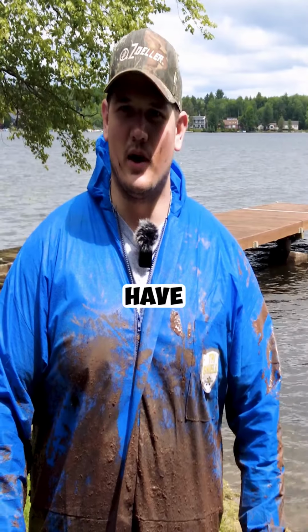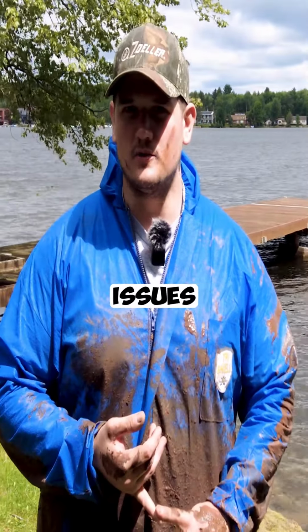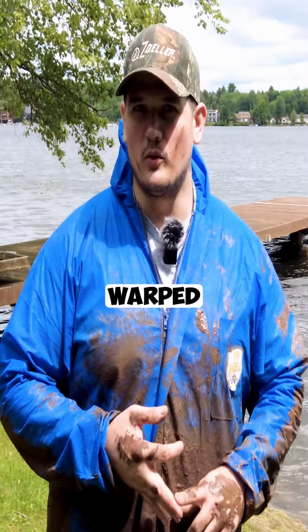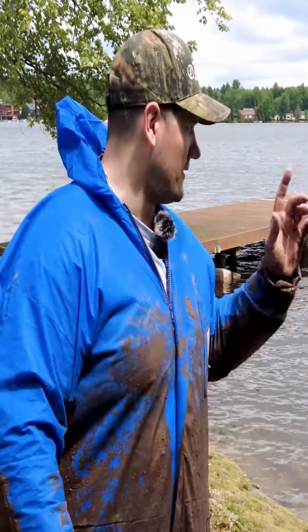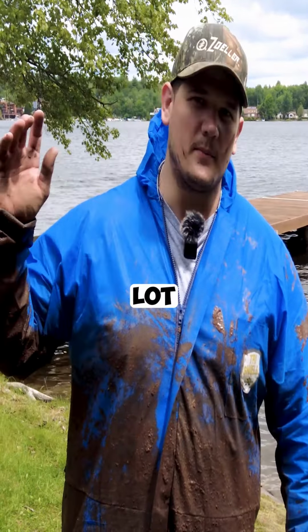So today we have a project over here in a crawl space over in White Lake, and was experiencing several issues. We had mold issues, we had humidity, and we also had warped floors, girder that was rotten, also with a sill plate and rim joist on the rear side, the closest to the lake here. We had a lot of moisture, a lot of mud, and there was a lot of improper support down there.